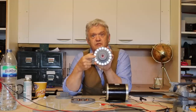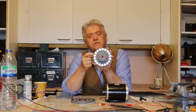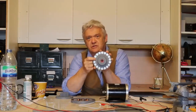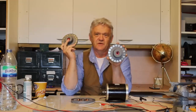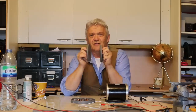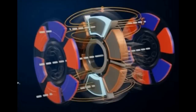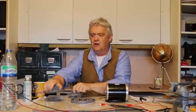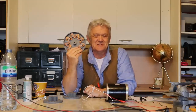I've put the files on Thingiverse. On this disc there are 18 magnet positions — 18 little holes — arranged north-south alternating. They use 15mm by 10mm N32 neodymium magnets. There's a partner disc which is identical, and when you put the two together the magnetic flux follows the axle, giving us straight forward axial flux lines going between the two.